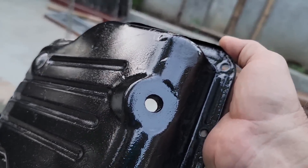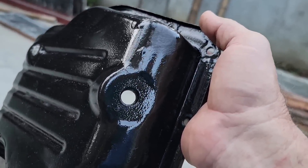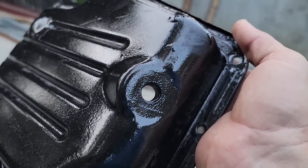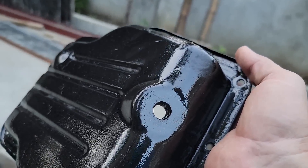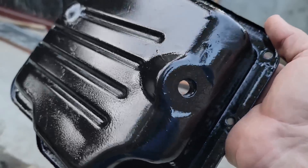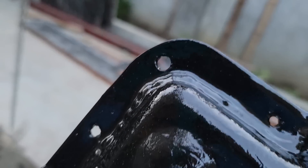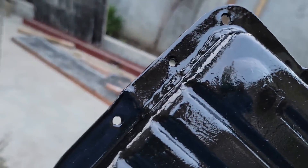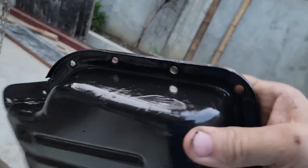I'm going to go ahead and put this back on. These are little maintenance things you want to do before you put the boat motor in. I told my mom when we brought this motor out — start looking for leaks, clean the bottom super good, fill it full of oil, set something underneath it and see if there's even one tiny little drip. We found two little drips: one where they did not put the bolt on the corner, and the other was the little weep hole from the weld job. But the pan is actually overall in pretty darn good shape.